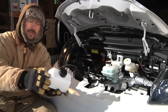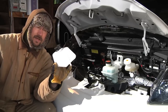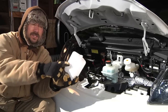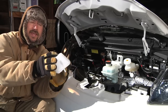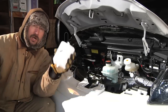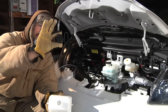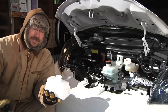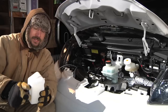This is a 1-liter fuel tank — something that might be used on a moped, a mini bike, or maybe a go-kart. It does have a nice barb at the bottom for connecting the fuel line, and on top is a cap which opens up pretty large to make it easy to add fuel. The cap itself is also a breather cap so that a little bit of air can go in as fuel is used up, so it does not create a vacuum.